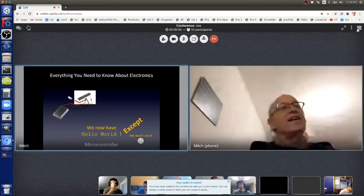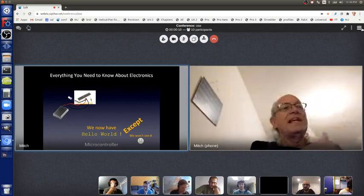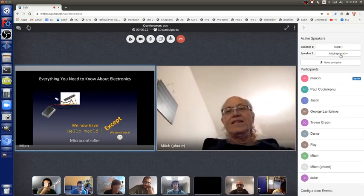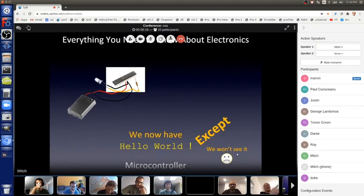Fast. This one is considered really slow, but it goes 16 million times a second. So in the case I just showed you, it will turn the LED on for a 16 millionth of a second, which is too slow for our eyeballs to perceive light before it turns off again. So what we want to do is, after we turn the LED on, making the output pin high, we want to delay a while and then turn it off.